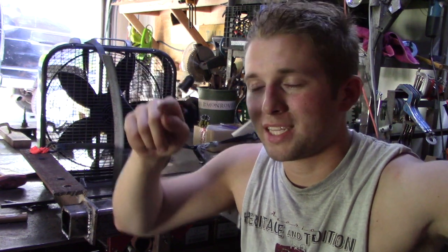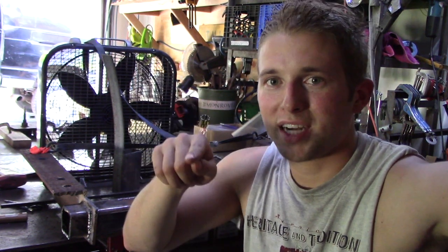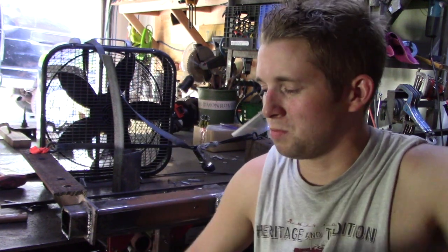I wasn't mastering it. I was getting big puddles, and then I went inside, cooled off for a little while, and went on YouTube, tried to learn some other techniques, and I learned that there are two techniques you can implement with 6011 that'll help it run smoother going uphill. One of them is where you go up and come back down a little bit, go up, come back down a little bit. I tried that a little bit. It was working okay. Another technique I learned is called an inverted T, where you go up, come back down, and then go side to side. It's kind of the same principle.